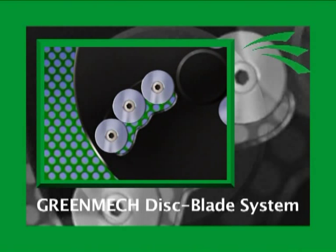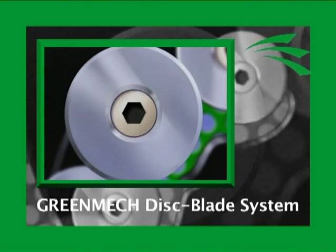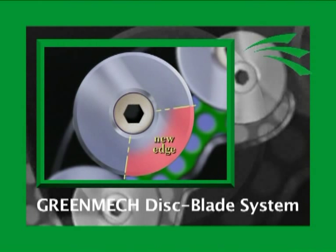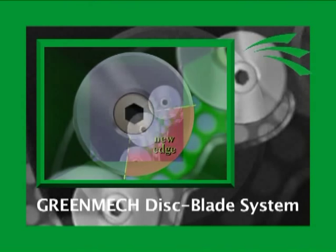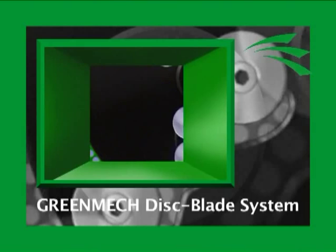This operator reckons the disc blade system has saved him well in excess of £1,000 per year over conventional blades. When a blade needs to be sharpened, it doesn't have to be removed from the machine. The retaining nut on the flywheel is slackened, the blade is turned 120 degrees to a sharp edge, and the machine is now ready to give you another 50 to 100 hours of efficient cutting before the blade is rotated again, or eventually taken off for complete resharpening.